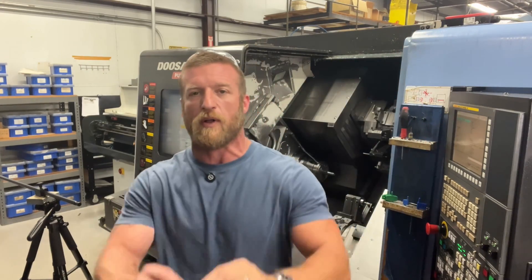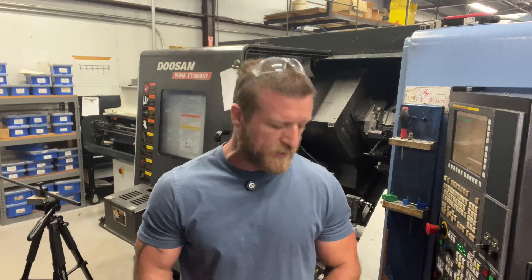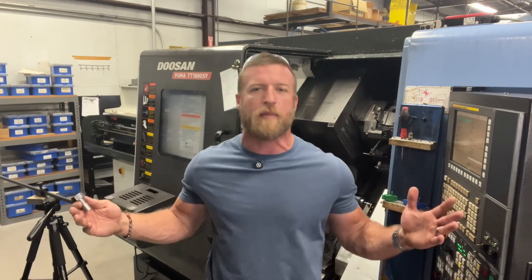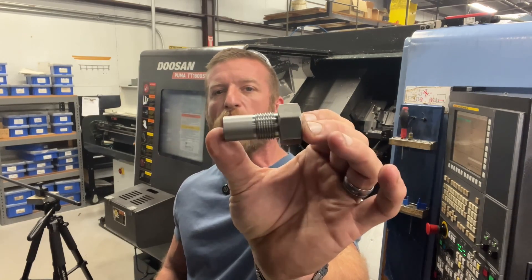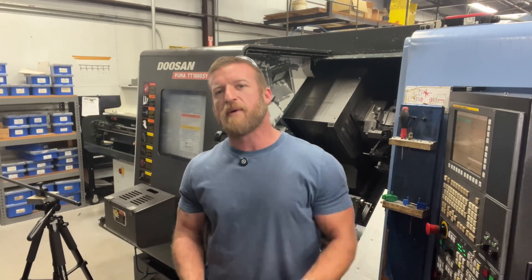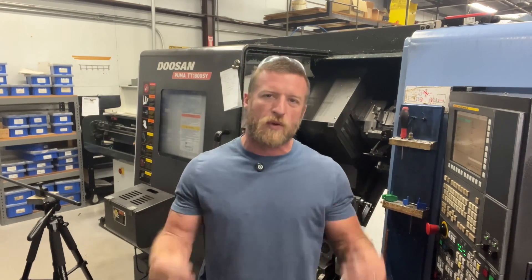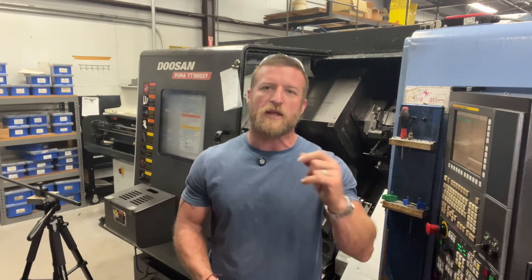And that's about the layout of the job. For a lot of you experienced folks out there, it's pretty simple. This diameter allows us a wonderful diameter to transfer. We run it very well — I think our cycle time is just about a minute 40 seconds complete. We have a little bit of a tight tolerance, plus or minus two I think, and the bore of course is plus or minus one and a half. Everything else is pretty wide open, and it's 1215 — it's gravy, baby. This is Luke at Crusader Machining signing out of today's video. I just wanted to give you a little rundown on how we run this part and how we lay it out. We didn't really touch on any programming — this was more machining principles and practices. Leave a comment below, what do you think of the video, what is it that you want to see? Like, leave a thumbs up, share the video, give me a follow. I really appreciate everyone watching — we're over 3000 subs now. Check me out on TikTok and Instagram as well at Crusader Machining. Once again, this is Luke signing out. Thank you for watching and we will see you next time.